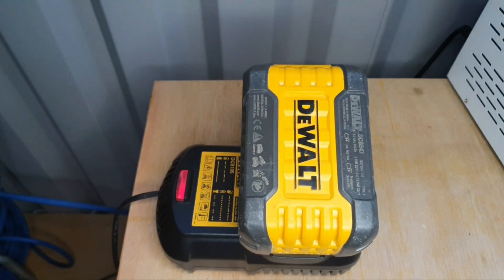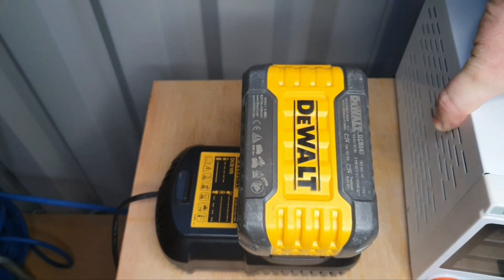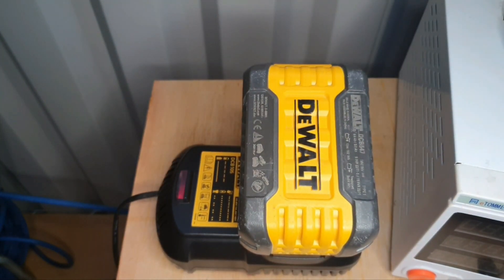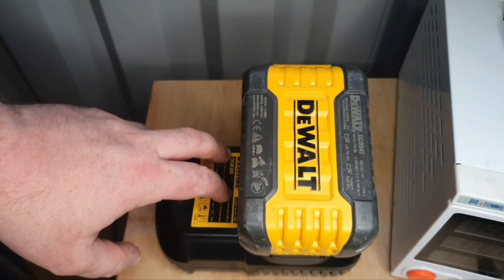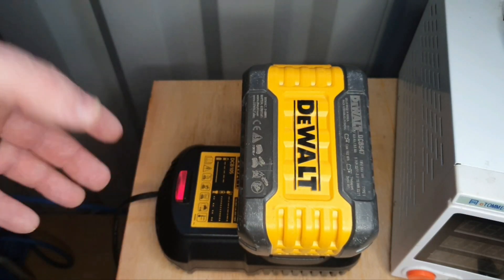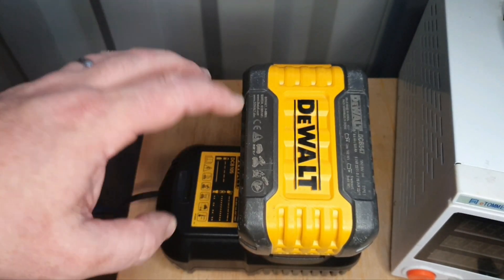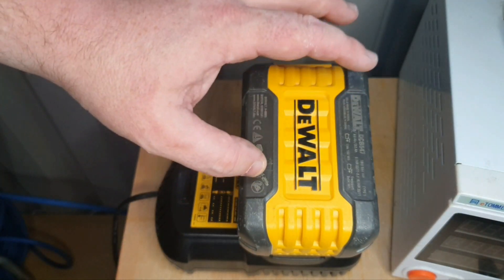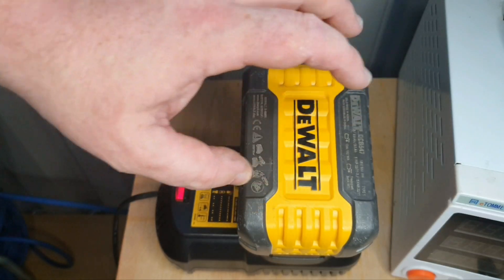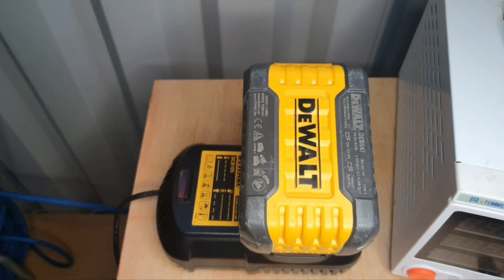To explain what I've done here: the voltage was low, so I used the power supply to bring the voltage up so that the charger could recognize it — so it's within the range of the charger. These chargers work in a range of probably about 16.5 volts to 20-odd volts, so if it's not in that range it doesn't recognize it. I've got it into the range, it is charging, and there doesn't seem to be anything else wrong with this battery, but we'll give it some time to see if it takes a full charge.